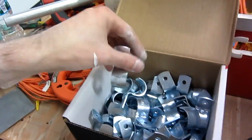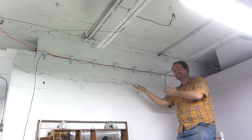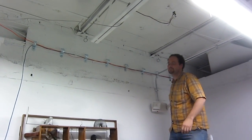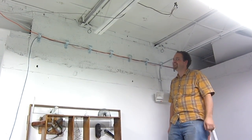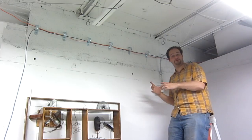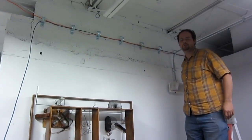I got something else for you guys — this is kind of cool. Hey Enos! You gotta show them the Chris Bowden cable tray concept. I'm rather proud of that. So we took a bunch of one-hole conduit straps, and because cable tray is really expensive, we decided to use one-hole conduit straps on one-foot centers, as modeled by our lovely Enos. This is going to be our cable trays throughout the lab. It's a hell of a lot cheaper than buying cable tray — cable tray costs a fortune. For small runs we get the one-inch; for big runs we do the two-inch, like up there. It's a good system.